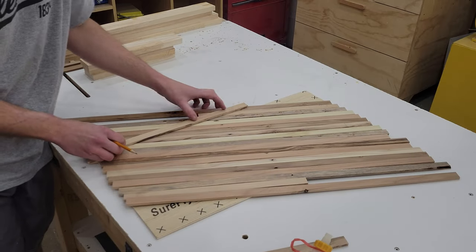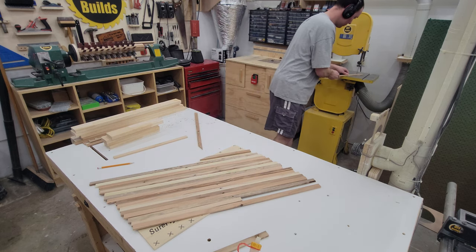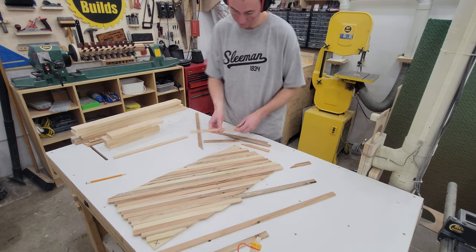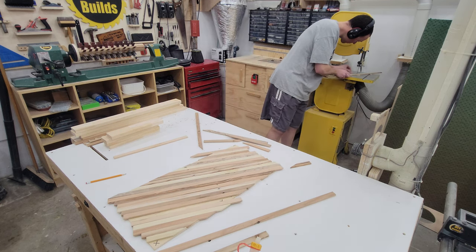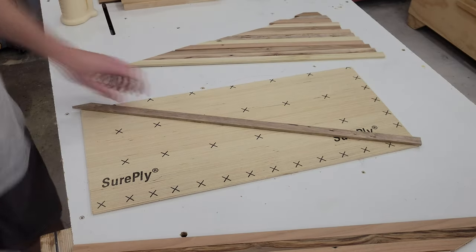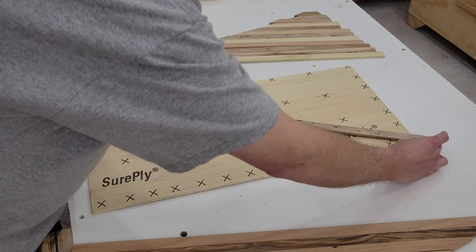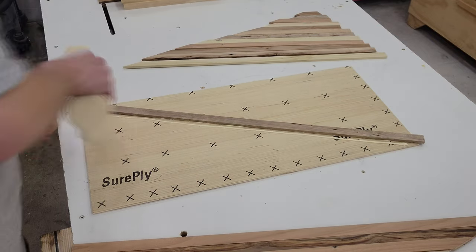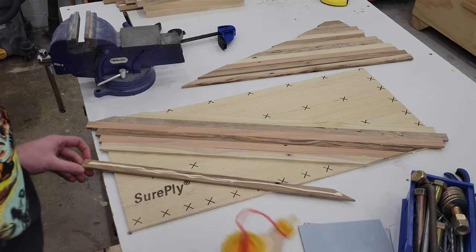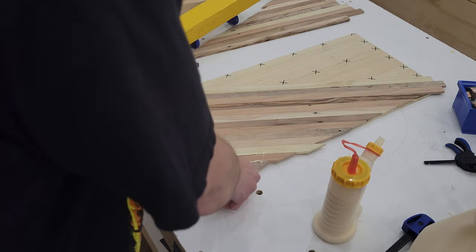I then mark roughly the edge of the plywood and cut out the excess at my band saw to reuse the strips in smaller sections. With the layout finalized, I slide the pieces off to the side and start applying regular wood glue to the back of the first middle strip. I start the first glue-up with only the three most middle strips and let that dry so I have a strong base to clamp against, as the rest of the glue-up has to happen in stages. The glue-up took a few days and I was always sure to have downward pressure to keep the piece from warping.